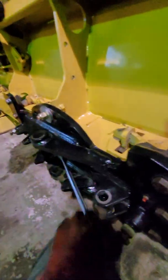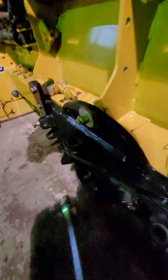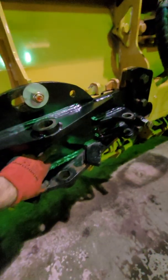You'll see there'll be some loose in the washers, and then these guys here, you just back them off. And you're going to want to tension this bolt here. You're going to want to turn it until it's basically a half turn under snug. If it's too snug, well, then it's going to bind and your swivel plate's not going to turn freely. So I've already adjusted that, and now it's a little too tight. I'm going to have to go over that again. No, there you go. So now it's swiveling. Now everything's adjusted, so it's obviously pretty tight. So I did that one.